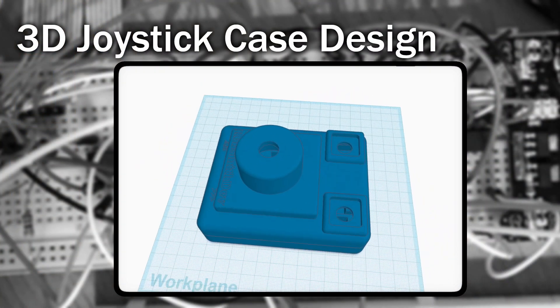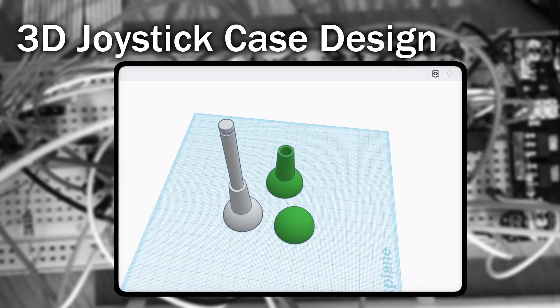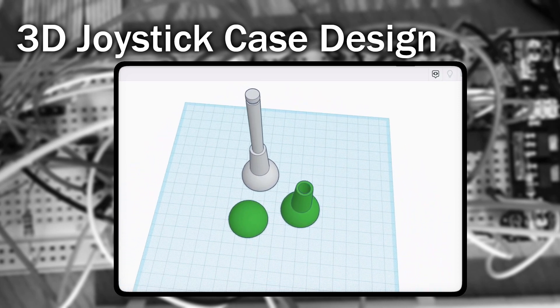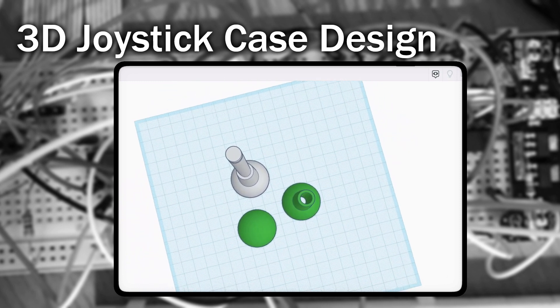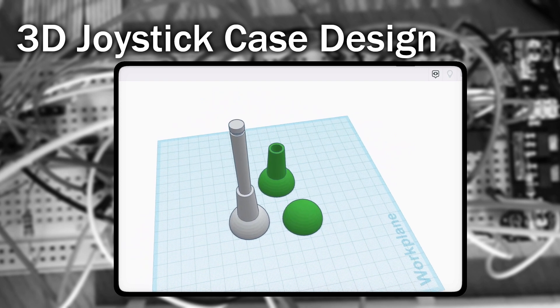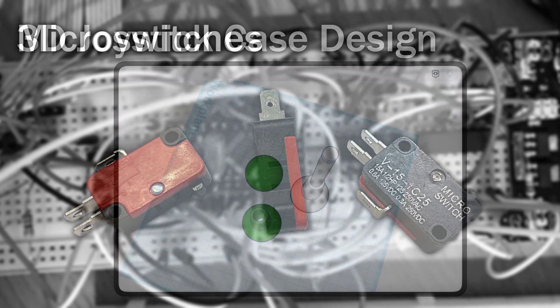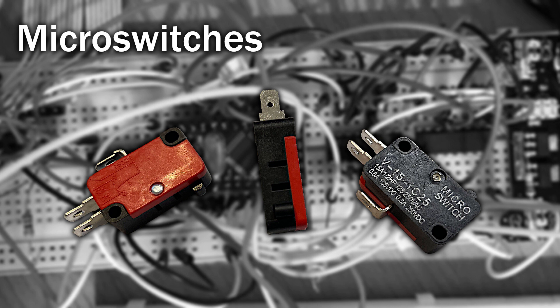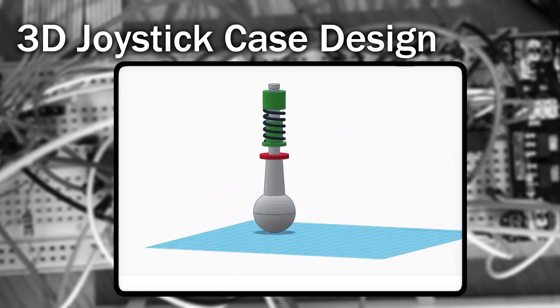So that's the circuit figured out but what about an enclosure? I like the look of the zip stick so I've designed something similar - it's not identical but it's close. Then we need the actual stick itself. I have two designs here and we'll need to pick the best one. Both designs have the top missing to make 3D printing easier. The first design uses a 3D printed plastic shaft - I have concerns this won't be strong enough and may easily break. That's why I've designed a second one that's hollow so we can run a metal rod through the middle. I'll be using these standard micro switches as they're fairly robust and easy to get, and from repairing my zip stick in the past I know that's what it uses.